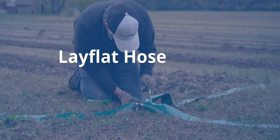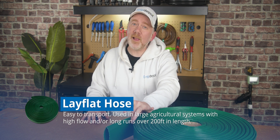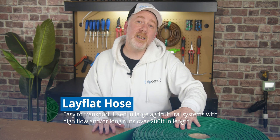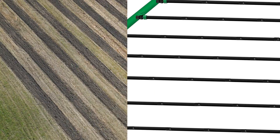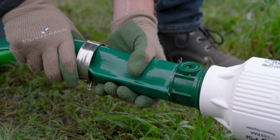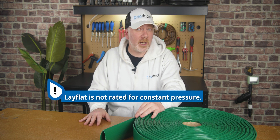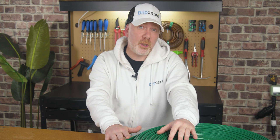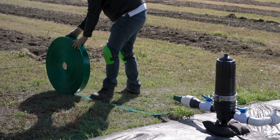Lay flat — often used in commercial drip irrigation systems. Lay flat, like vinyl tubing, is actually a type of PVC. However, unlike PVC pipe, lay flat can go completely flat, making it easy to transport and store when not in use. This entire roll represents a football field's worth of lay flat. Its most common use in an irrigation system is as a manifold for drip tape or poly tubing rows. Its flexibility and ease of transport also see it used as a common water-carrying line, dragged around like a hose from one section to another. It tends to be used on lower pressure, higher flow drip irrigation systems, and is often not available in sizes smaller than one and a half inches. Lay flat is not rated for constant pressure and must be relieved of pressure when the system is not in use. Though resistant to freeze damage, it must be run in straight lines as it cannot turn or bend when pressurized.